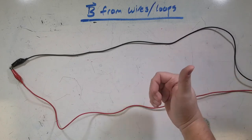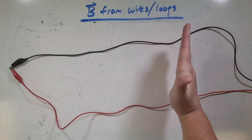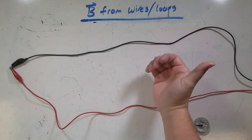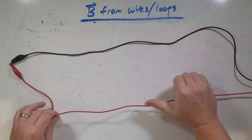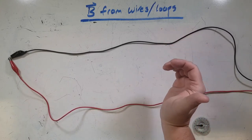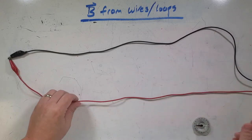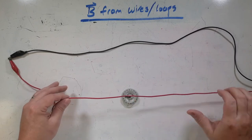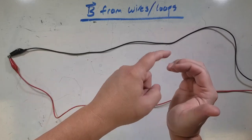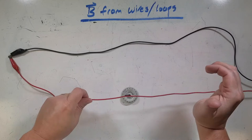This is the curl right-hand rule. You're going to take your right hand and curl your fingers — kind of like you're an Aggie. Your thumb is going to represent the direction of the current, and your curled fingers will represent the direction of the magnetic field. So this is going to make a loop. If I want to know the field down here, I take this wire, point my thumb in the direction of the current, keep my fingers like this, put my fingers where I want to measure, and that'll show me the direction.